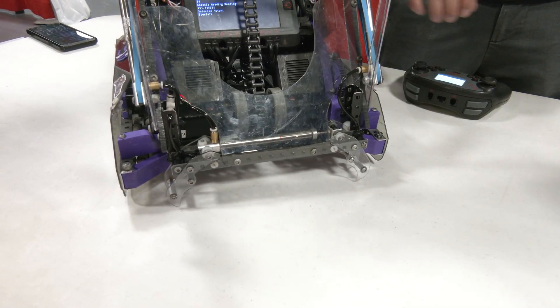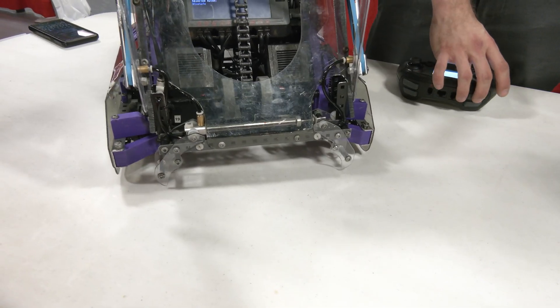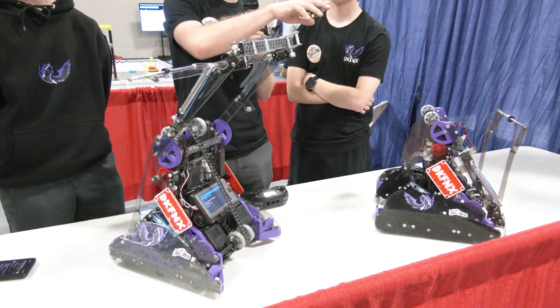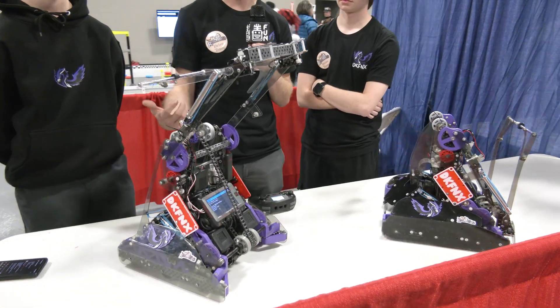The second part of the robot to score — instead of a Lady Brown — we are using a pneumatic claw. I know that when we talk about claw mechanisms sometimes, it's not something people think is good. But in this case, it's allowing us to be even faster than most mechanisms. We just lower the lift, have a ring come through, lift the arm and ram it to the high stakes, giving us a bigger range of motion and more speed than most Lady Brown designs.